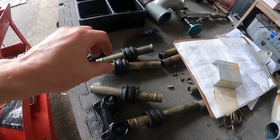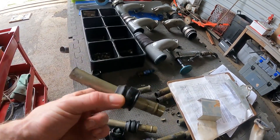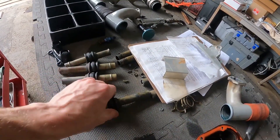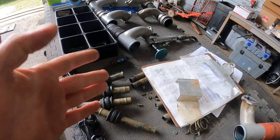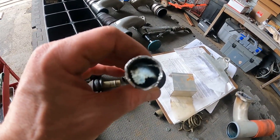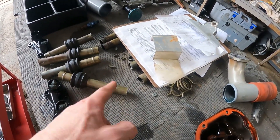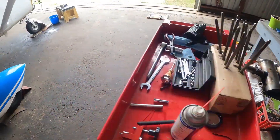You can kind of see over here at the parts table — we just destroy these things to get them out. Normally you'd pull the cylinders, but we're not pulling the cylinders on this aircraft. You can just run a sawzall through them and get rid of them. We are taking caution: you can see there's a wad of paper in this tube. While these are in the engine, we're stuffing shop paper towels down here so when we cut, there will not be any metal going down into the engine, the pusher, or the lifter.